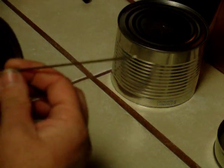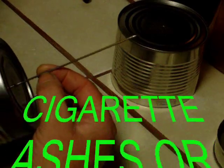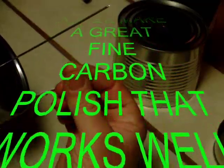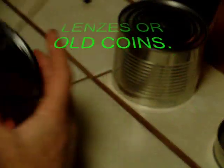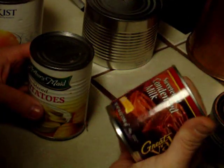If you really want to get this shiny, after you've taken the acetone or fingernail polish remover — which is acetone — and got it all clear, you can take some ashes and a piece of notebook paper, put the ashes in the notebook paper and wrap it around it, then move that up and down real fast. That fine carbon will polish this and quiet your machine up quite a bit.